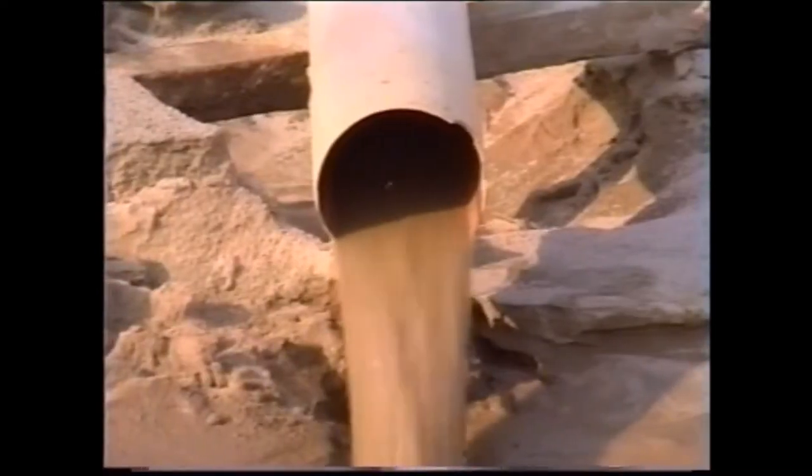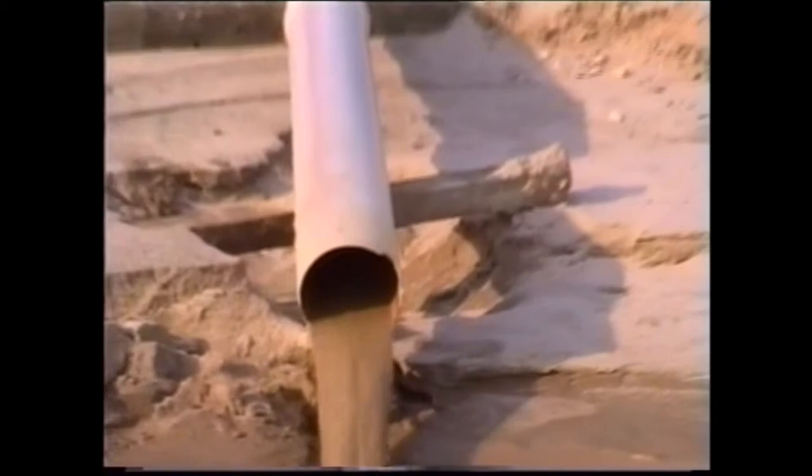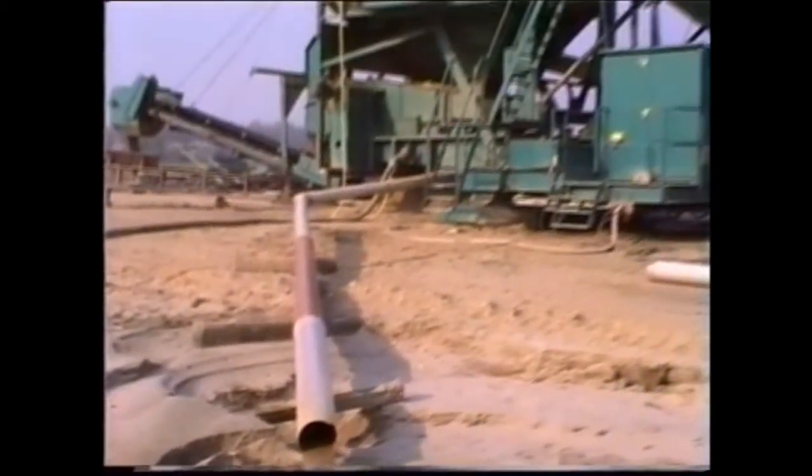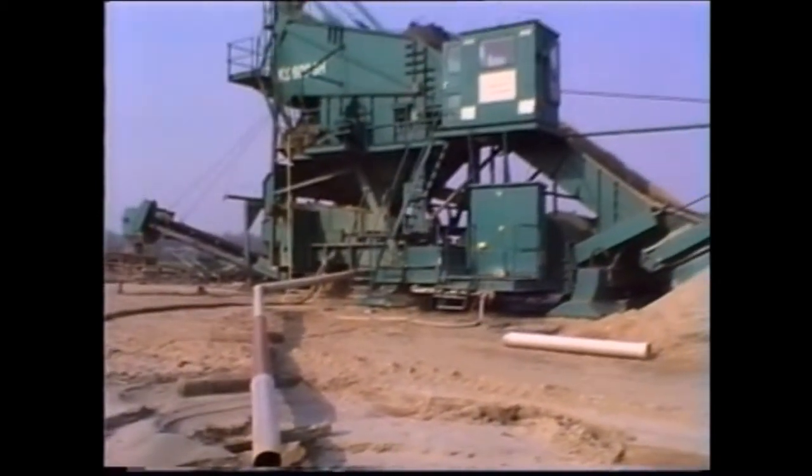The reciprocating feeder again. The electronic control switches it on and off and opens and closes the pendants as the material flow requires. The wastewater from the dewatering screen either flows back into the pond or, as required, can be channeled back down the scraper ramp. This circulation effects a forced separation of the fines.